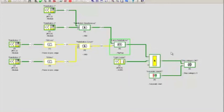If I therefore remove one hand from the button, everything must shut down, since the hold is a false now, and I cannot re-trigger this operation. And that's one of the important requirements of two-hand control, that it's anti-tie down and anti-repeat. I need to take both hands off before I can restart the system by putting both hands back on.